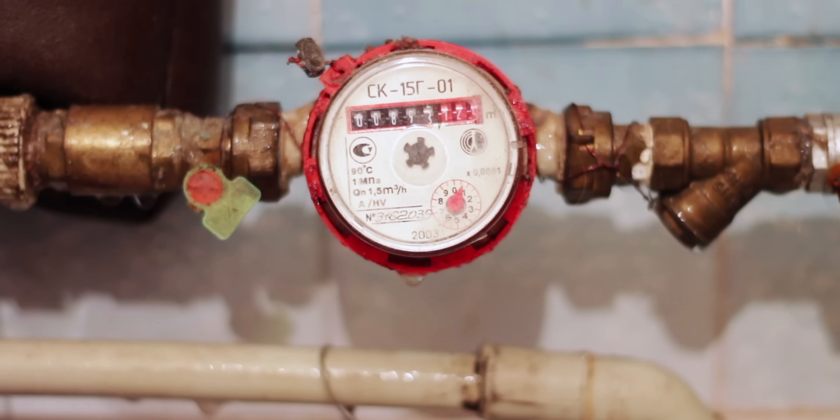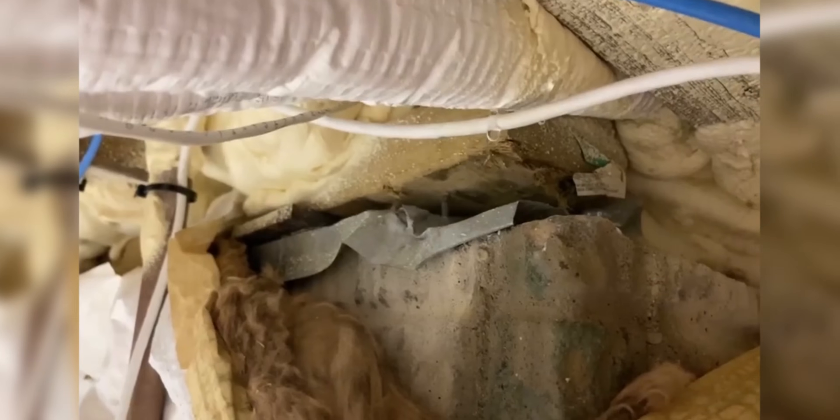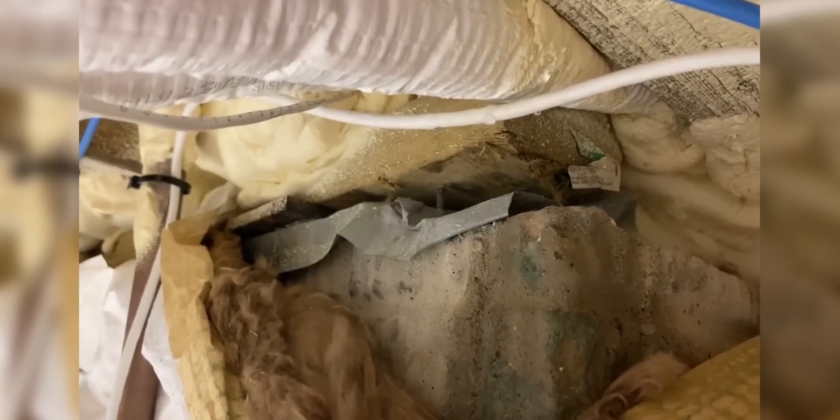You can approach it a couple of ways. First, I recommend just looking at the meter when you pull up — is the dial spinning? Then go to the house, look at where the water is, and look at how the plumbing lays out. I got a call one time about a puddle on the floor in a garage. The way the house was plumbed, I told them this has nothing to do with plumbing. He ended up finding out he had an HVAC system above it that leaked. I saw the stain on the ceiling, so it was pretty easy to figure out, and I could direct them to someone else.